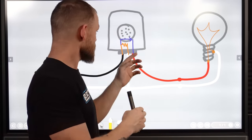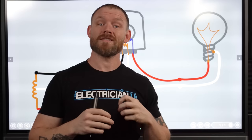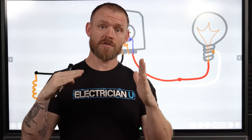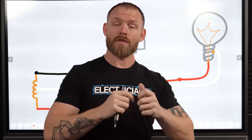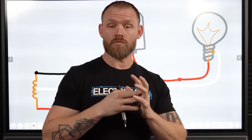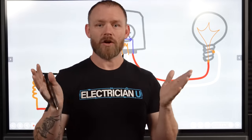The control circuit can change state. If something is normally closed, meaning the black and the red are always touching, when you energize it, it opens them. If something is normally open, it means from the factory, off the shelf, it's an open switch, and when you send current on a control circuit it closes. In this situation, when you pull a photo cell off the shelf, it's in a normally closed state — it's once you add a circuit that it opens the state.